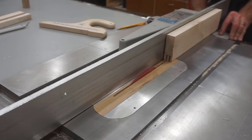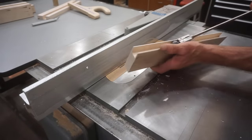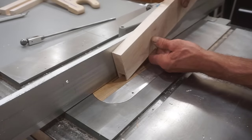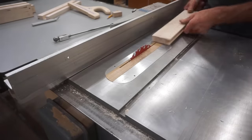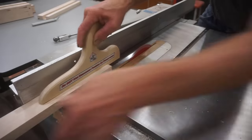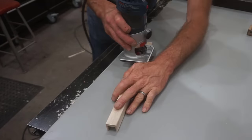As you can see from the jacket profile sketched on the end of this block, this jacket is more dado than jacket — which is why I left it in a bigger piece of wood. I've got a big piece to hang on to while cutting the dado, and then I can much more safely rip the jacket free of the bigger block. Because the dado is centered in the edge of this block — since the weld is centered in the face of the tube — I can flip the block end for end and set the fence half as many times to center up the dado. In millwork it's often about sequence, sequence, sequence. I run the eighth inch round over bit along the corners to finish up this jacket.